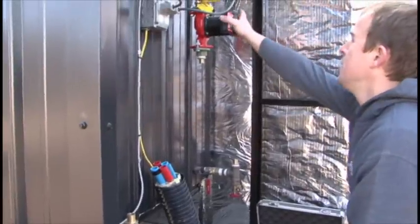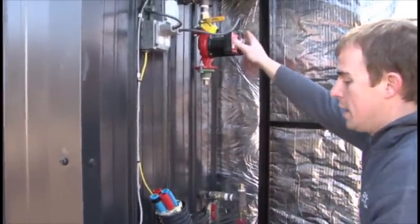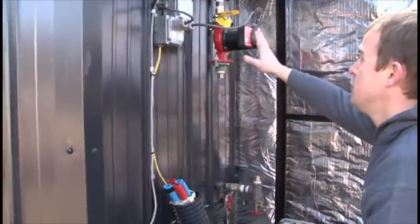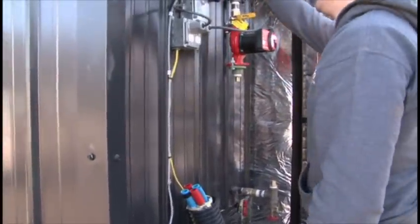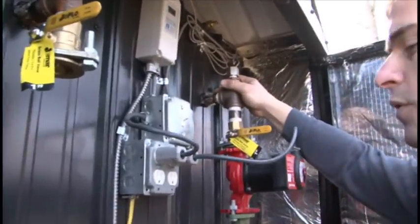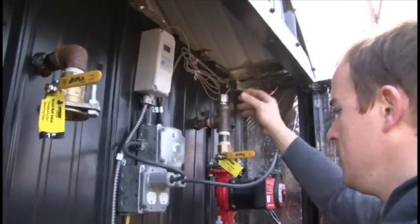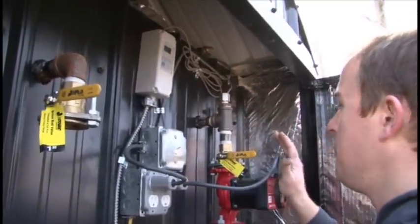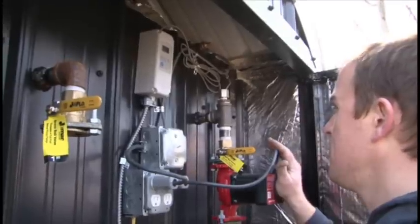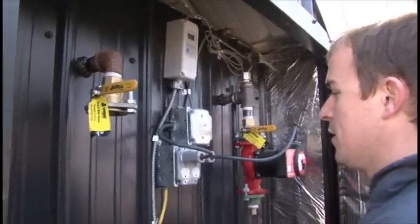Always remember that if you're going to run two pumps, the pump on the right hand side of the unit is your primary pump. The reason for that is this is where we monitor the water temperature of the unit. So if you're heating a home, you will definitely want the pump on the right to be the pump servicing the house, and not a garage or a shop — something you might want to shut down at different times.